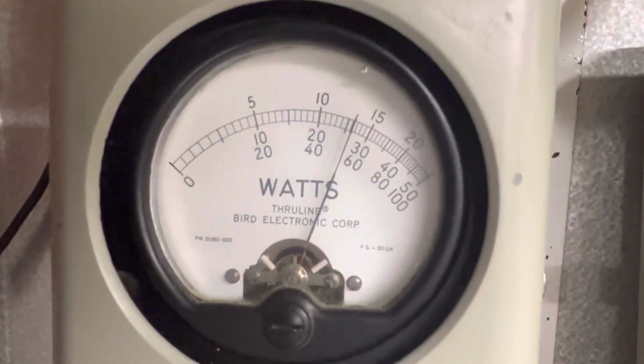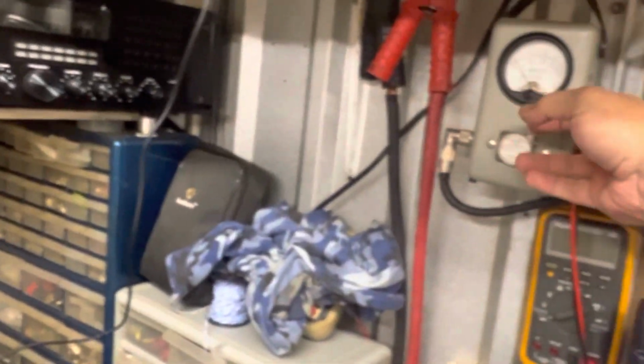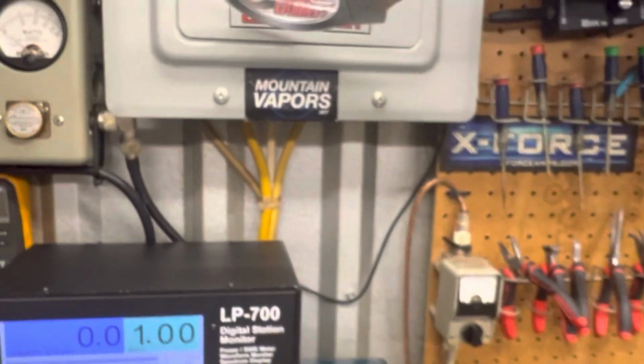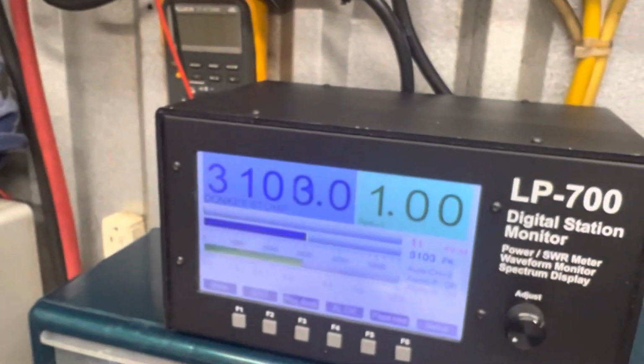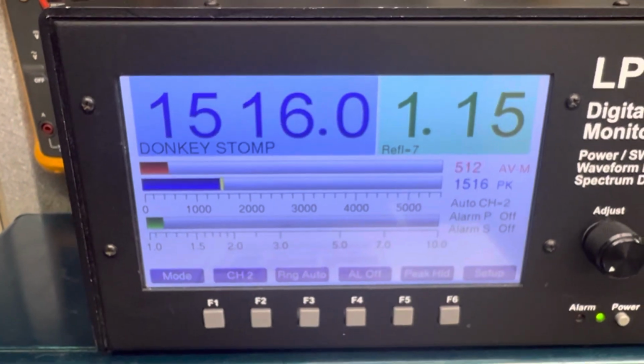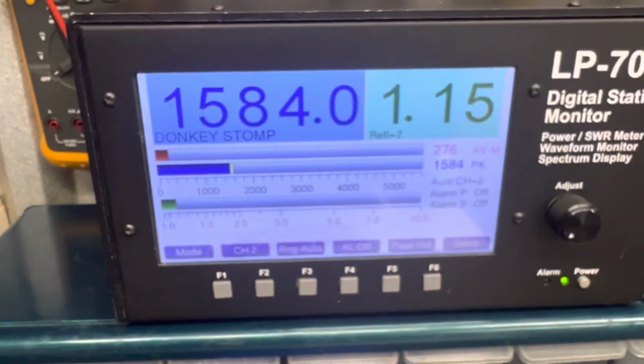2,500 watt slug on the Bird. See what she does on the Bird. Six pill, C box on the Bird. Seems like the C boxes work real good in that configuration. She's showing about 1,400, 1,500 on that. All right, we're going to drop down to 14.2 just to get it back to car volts. Radio drive. It's on 14.3 or something. Radio drive on 14.3 didn't make a lot of difference right there. Still making great watts, man, that's just great. That's just really good numbers for a 6-pill.